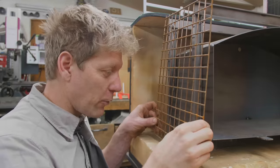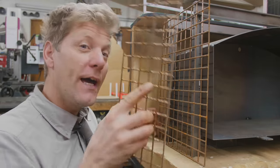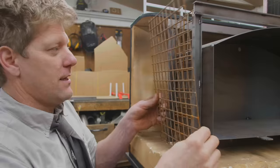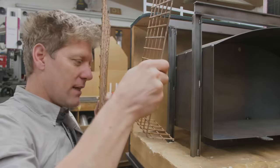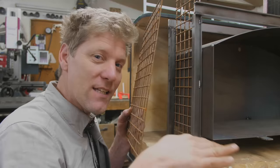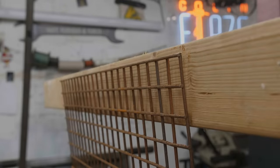It's in the reinforcing mesh application where things started to differ. Here's Colin's rebar — he just slides that down into the concrete for the floor slab, which was a nightmare to put in. But the structural engineer wanted a second one right up against the wall behind it — and not just flat, but bending and tying into that bottom floor slab so it keys into the bottom bit. The forces on my walls are coming from the weight of the ceiling, the expansion of the clay, and the rock basically trying to push itself into the room. When something pushes against the concrete it tries to bend it, and as it bends it loses height. By bending that rebar around you divert some of those forces so they're not just pulling up but pulling across, distributing the load further.